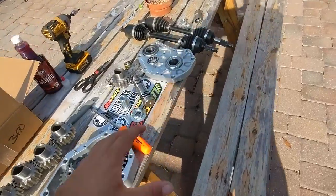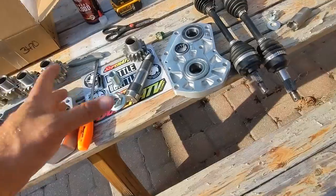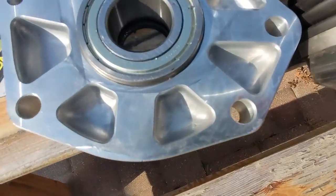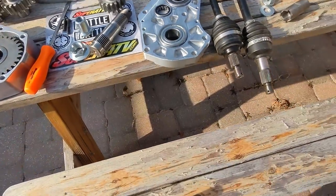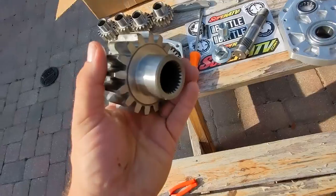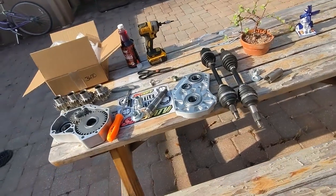A few more parts in — a lot of shiny stuff on the bench. We took one of our 6-inch Pioneer 1000 boxes and opened it up. Big, beefy gears inside. The Gen 3s have these neat bearings with a race that sits on the idler gear — pretty sealed, pretty beefy, with giant shafts. It was kind of hard to open up this box; the best way was to pick it up from the cover with two pairs of pliers and tap it. The gear is a little bit of a press fit into both sides of the case bearings.